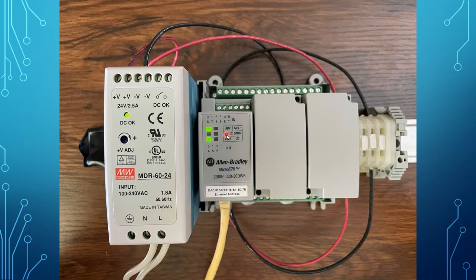As you can see, the Micro 820 PLC is what we call a Micro PLC, so it's small and DIN rail mounted. There are a fixed number of embedded I/O points, meaning there are so many inputs and outputs embedded in the controller — available on the green terminal strips on the top and bottom. We also have two places here for plug-ins to expand our I/O capability.